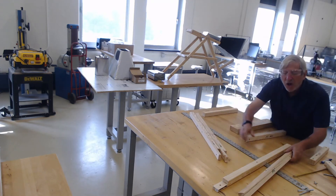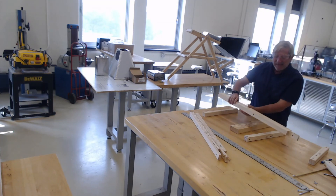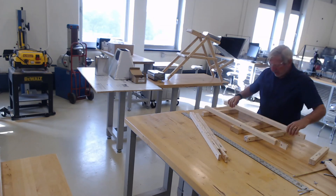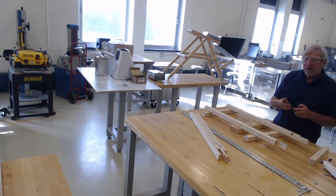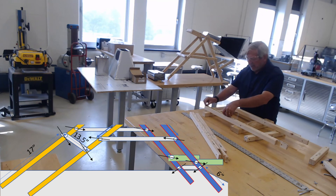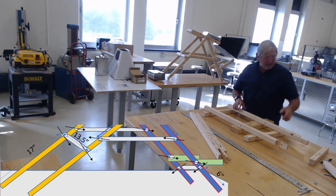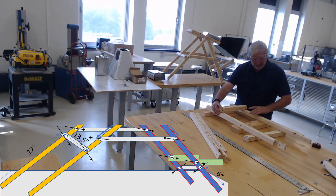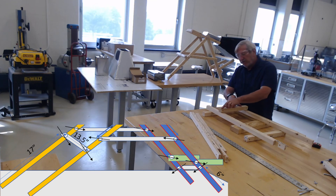We're going to take the two long pieces. Once again, make sure that these sides are perpendicular to the table — we don't want to drill on the long side of the wood. In this case you'll notice we're measuring up six inches. So I'm going to come up here, make my mark at six, make my mark at six again, take my cross piece, line it up with the markers, and then drill my hole three-quarters of an inch from all the sides on both sides.